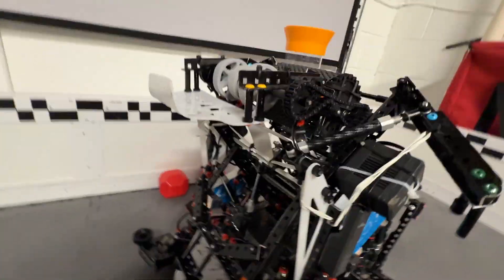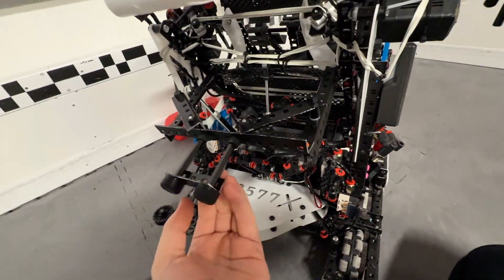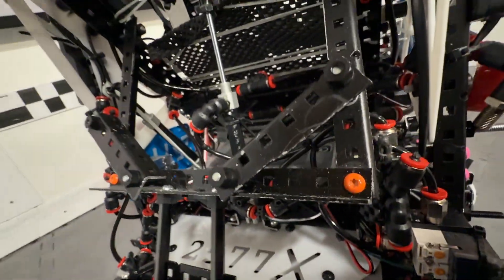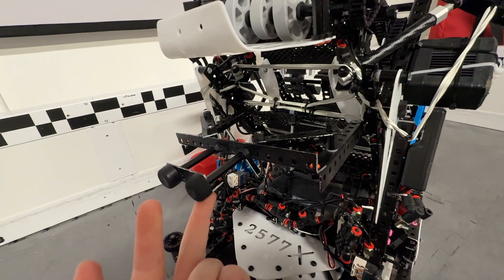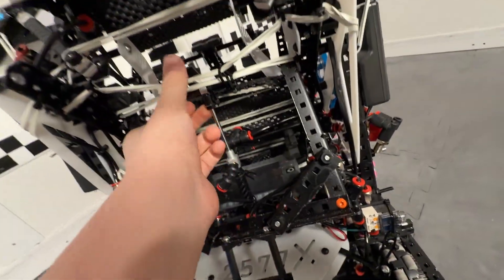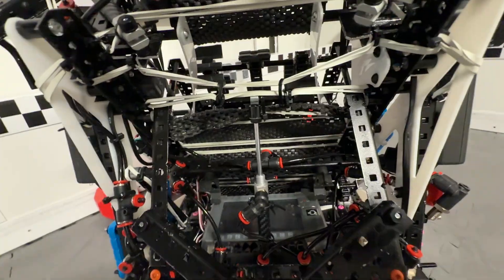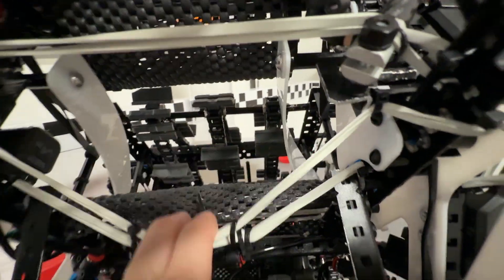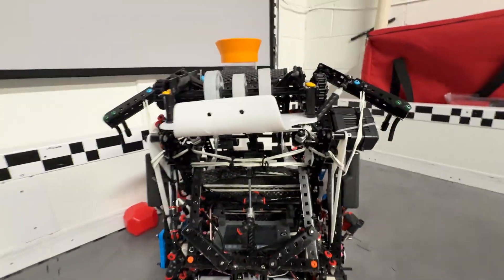Moving on to our D-score max — it's basically a middle goal D-score mechanism. It's kind of overbuilt and heavy, but it's fun. All of our pistons are single-acting, so we save air. The piston goes into the center goal and can D-score a whole goal at once, which we've done at our most recent comp. Our center goal scoring is pretty standard — this piston goes down to score on the center goal. We later added these standoffs when tuning it, because they make sure it's pulling down over more areas rather than just a V-shape, creating more of a gap for the block to fly through, which improves our intaking by a lot.